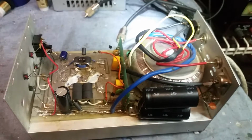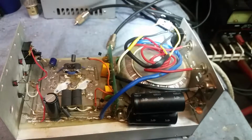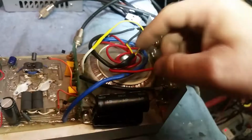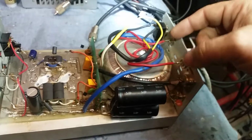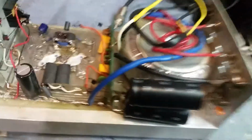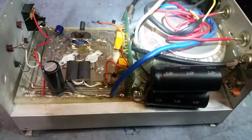I think they should have put this in just a bit of a bigger case. It's kind of neat the way the transformer is actually grounded to these points right here to the case. So your actual DC ground is coming through the case right here. Those are rectifiers as well. Some weird rectifiers. I've never seen them but on these boxes. Alright, I think I'm going to throw some 80-watt transistors in here, man. Hopefully pull that transformer's voltage down a little bit too.